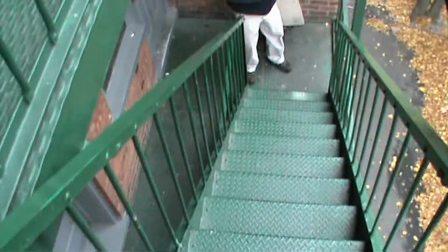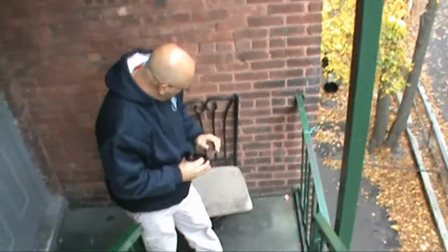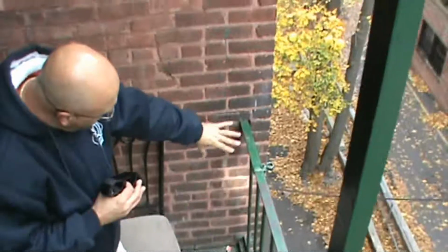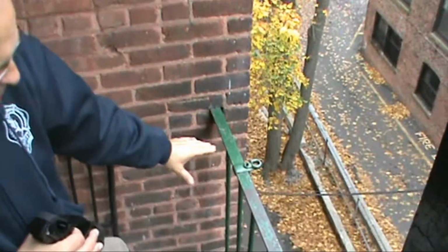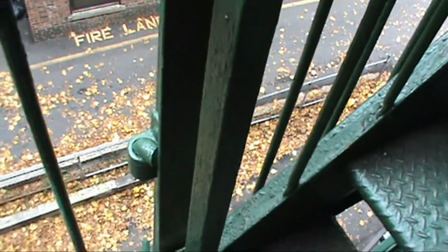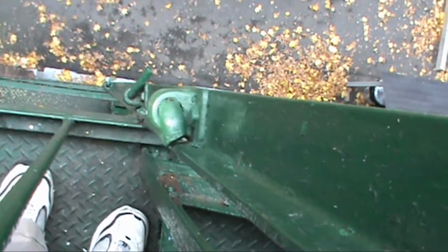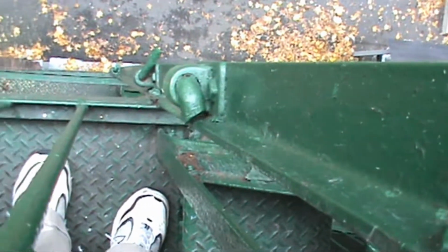Okay, come on down. Again, the cement issues into the wall, all these need to be repacked, standard on all floors. Again, try to remove these knuckles because these knuckles are eating the steel. And if you look on the outside, you start seeing that this reinforcement T-bar has got some rust in it, so look up on that. And any place that has rust should be silicone shut and closed.